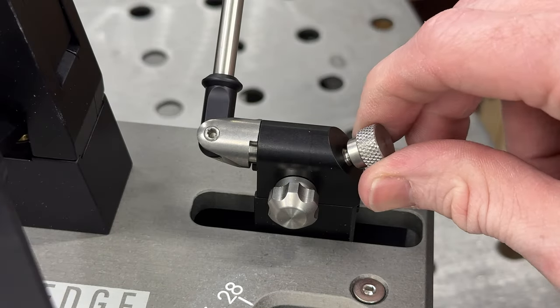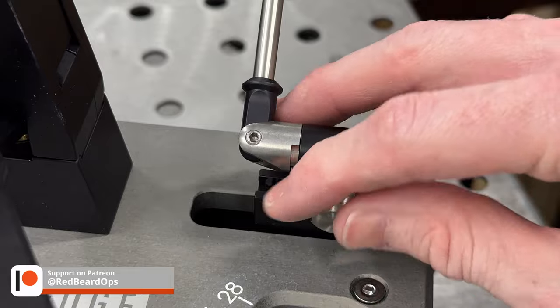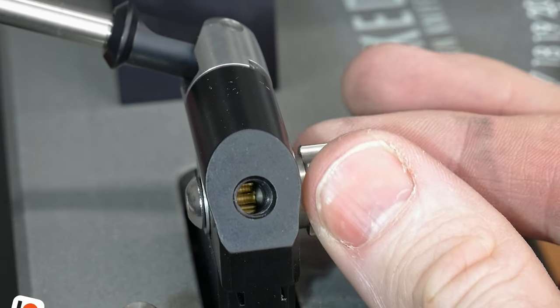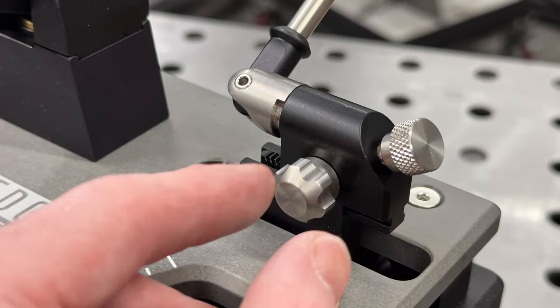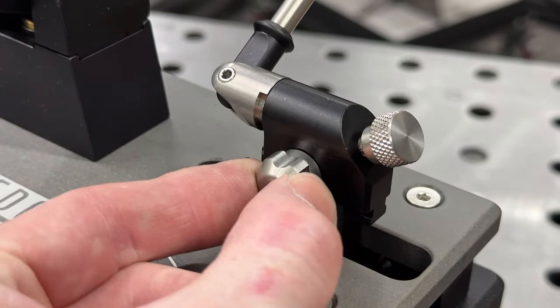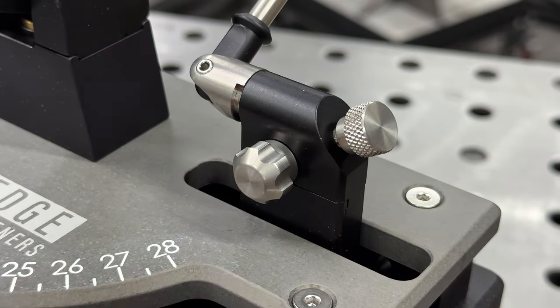The Gen 4 not only has a jam bolt off axis to the joint, but also a rack and pinion system to advance or retreat the fine angle adjustment. It seems pretty robust overall and allows the user to add about 5 degrees of angle on each side.